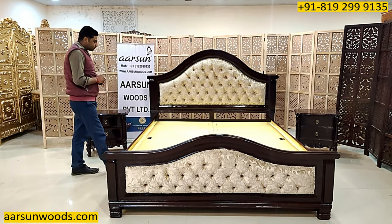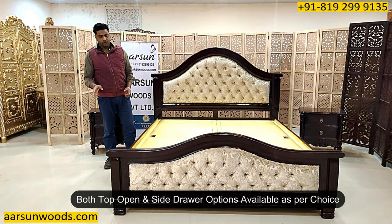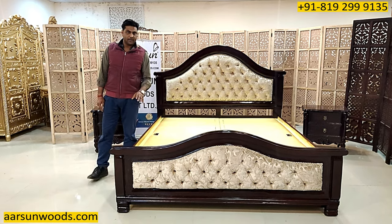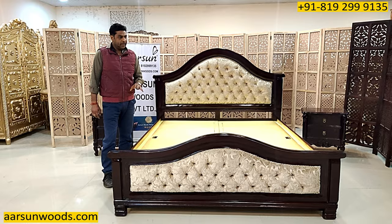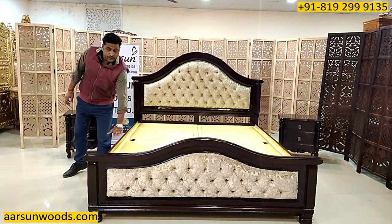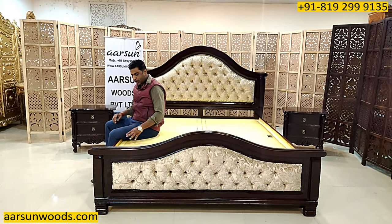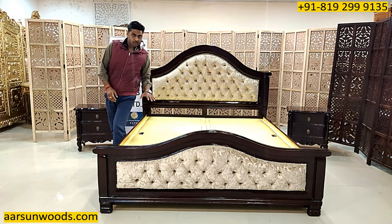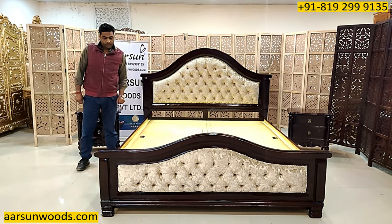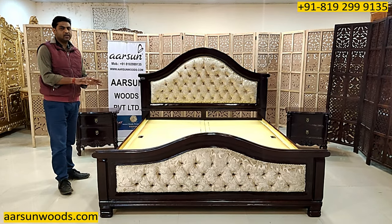Storage is a nice concept — you can decide which type you want, side or top. The side one I'll show you in a few days as we are making that. Regarding the storage concept: if you are using a mattress more than 8 inches high, the storage gets too small. The comfortable sitting height is around 22 inches, and anything higher means you need to climb over the bed. So this storage is a comfortable height. If you have a thick mattress, we have to reduce the size of the storage, and generally if you have anything more than 12 inches, storage doesn't work.